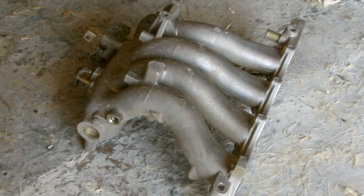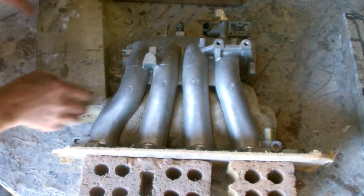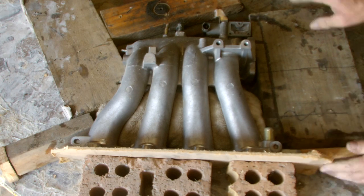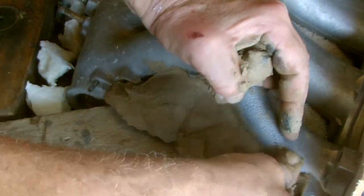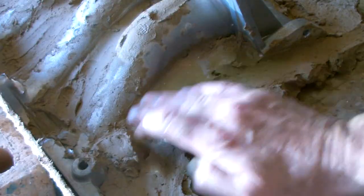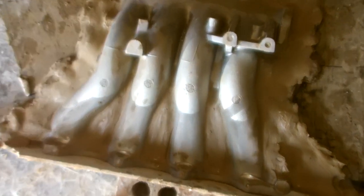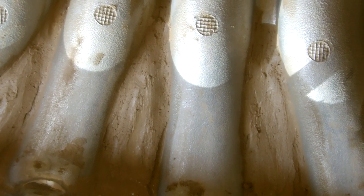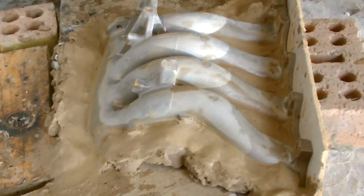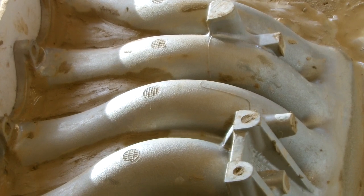What do you do when your flange line is in a curve? Well, this is one of my favourite techniques. This inlet manifold is about as complicated and curvy a shape as you could get — let's see how we could mold it. This intake manifold now has a clay wall all the way around it where I want the flange to be, and the holes in between the intake tubes are filled with clay as well.